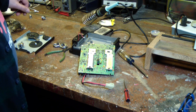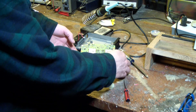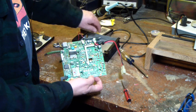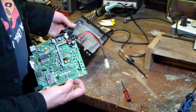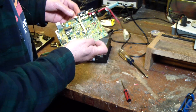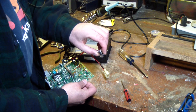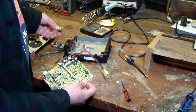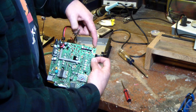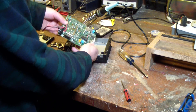I've got the board out of the radio. The way this was put together was kind of interesting — the board sits down in the chassis, which is a solid block and basically your heat sink. The only tricky part was the SO-239 connector comes in through the back chassis and is soldered directly to little extensions off the board. So you had to desolder the SO-239 and then take a bunch of screws out, then the board just lifts out.